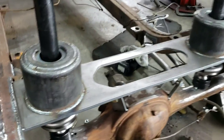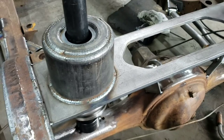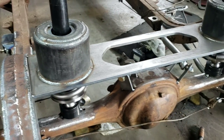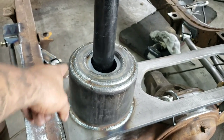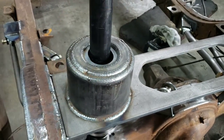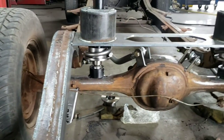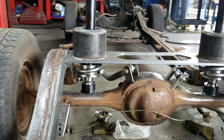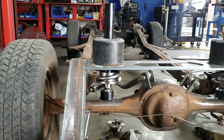And everything else, we went ahead and did the pockets for the coil. We're running a 1-ton coil back here because I believe he's only gonna be running about 4 batteries in this car. We added some reinforcing on the main pocket that way it doesn't push through and protrude through. But as you can see right now, I'm just kind of jumping on it right here. It's just tacked together, so I don't want to push too hard.